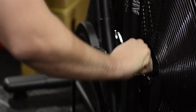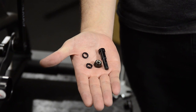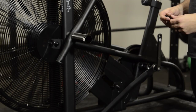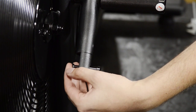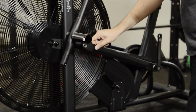Now, find two number 37 pivot pins, four number 84 washers, and two number 85 lock nuts, which will be used to install the linkage arms to the handlebar bottom ends. Using one number 37 pivot pin and one number 84 washer, insert into the handlebar toward the frame.